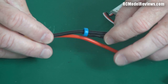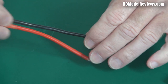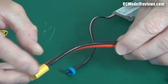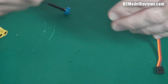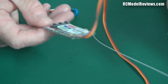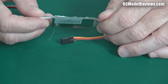In a small model, it's much lighter, simpler, and more effective. If you have a larger model and want to swap things around, you can make up a lead with the opposite connector and simply unplug between the battery and ESC to move it from model to model along with the transmitter. The transmitter has a simple wire antenna — run it well away from the rest of your gear. They say the range is about 300 meters, or a thousand feet, which is probably enough for most people's flying.